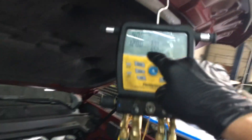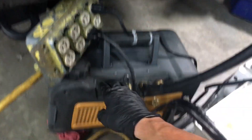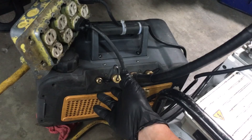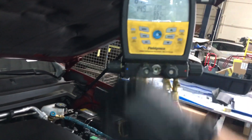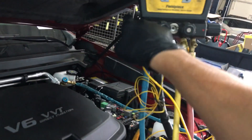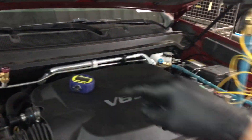Then if we look up here at 900 microns, it's only coming from one vacuum hose — this is just a yellow jacket vacuum hose going to a Field Piece 8 CFM vacuum pump. It's only capable of roughly around 900 microns — it's hovering right around in that range. But it is open to the system; both of these are attached and are depressed into the system.